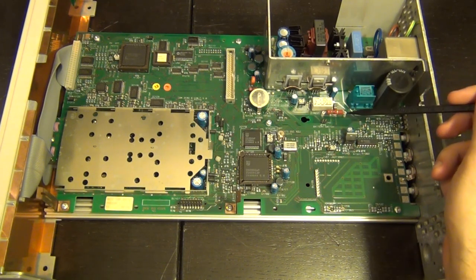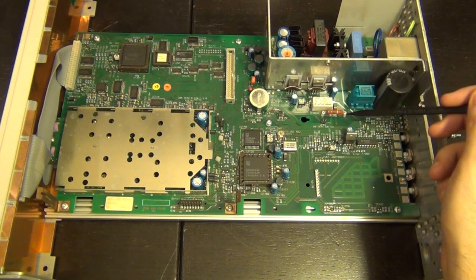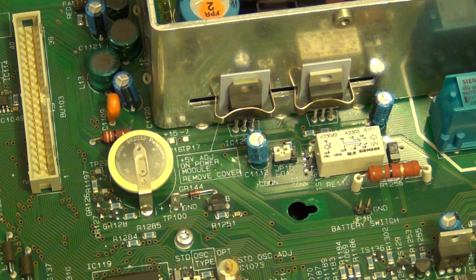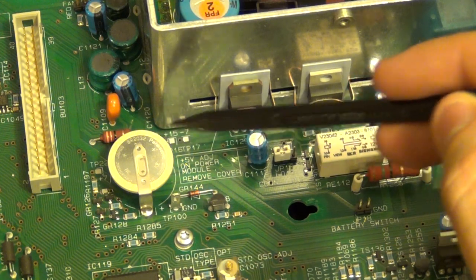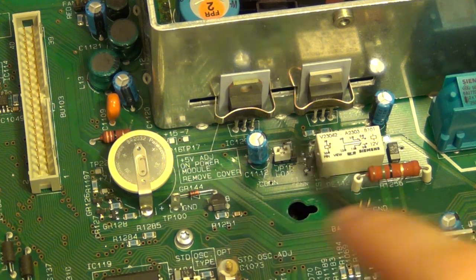Big resistor over here as well. It's actually offset with ceramic insulation. I don't think they're ferrite cores, but some ceramic insulation. Pretty cool. Let's do some more measurements on this. So certainly some nice labels over here. You can see I see minus 7 volts, I see plus 15, I see plus 5, I see plus 7, and I think I saw another one as I was just browsing, but certainly they're labeled over there.